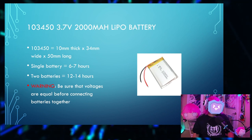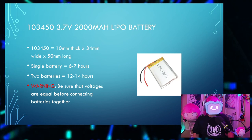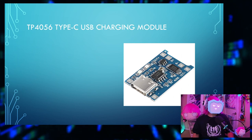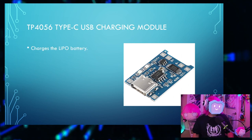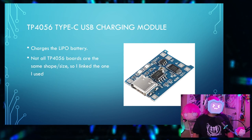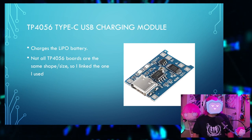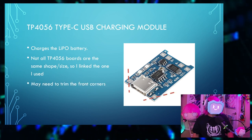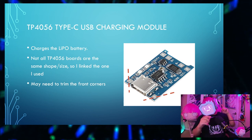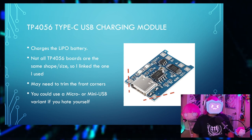But, and I cannot stress enough, be sure that the voltages are equal before you connect the batteries together, or bad things can happen. And to charge the battery, you'll need a TP4056 Type-C USB charging module. It charges the LiPo battery by USB-C, and not all TP4056 boards are the same size and shape, so I linked the specific one that I used in the description. You may need to trim these front corners in order to better fit the circular shape of the ear cup. You could use a micro or mini USB variant if you hated yourself.